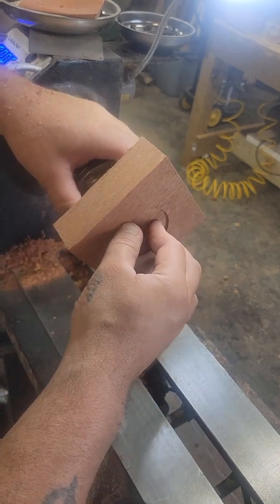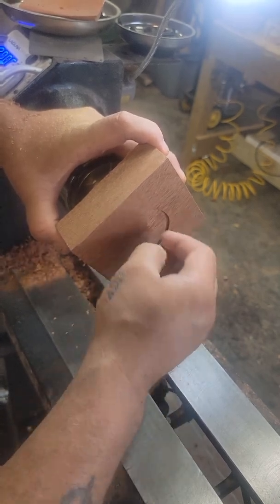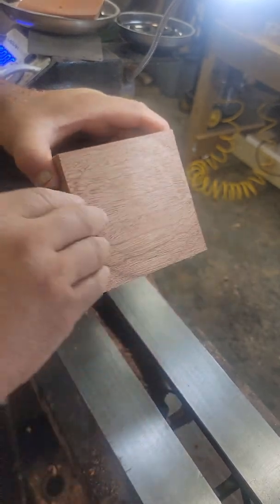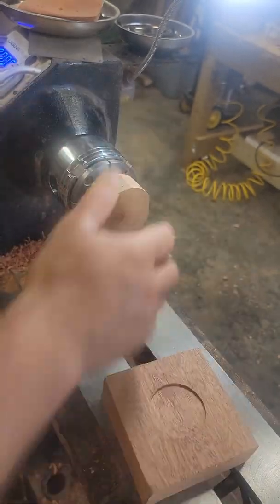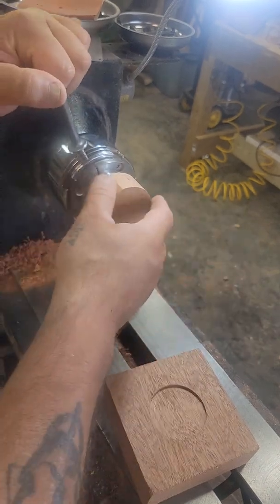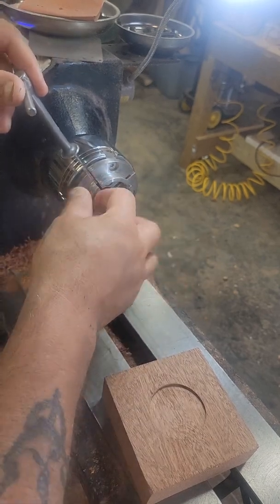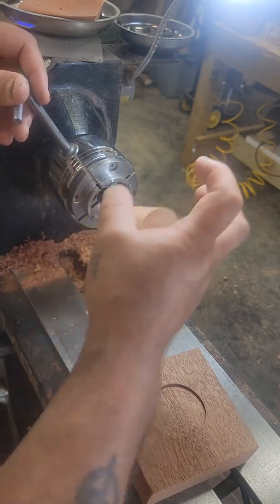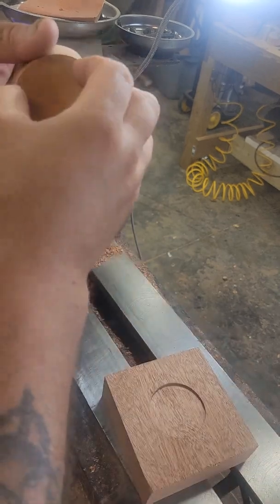This takes away most of the possibility of the wood splintering as you open a chuck, and it completely removes the possibility of the wood shearing as you use a tenon and compress the chuck. Another thing to notice is this is a little bit different. I mean, the same things occur, the same forces occur. However, the Nova chuck has a dovetail, both internal and external, and there's a little bit of a ridge here on the inside lip that can grab and seat in the grain and help create a crack and separate it.